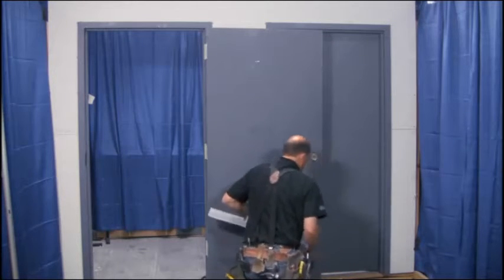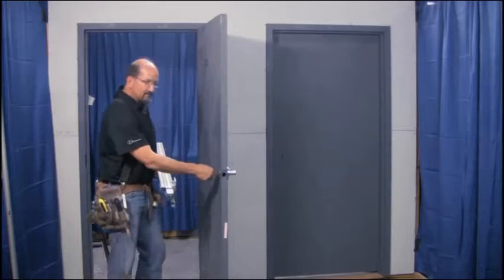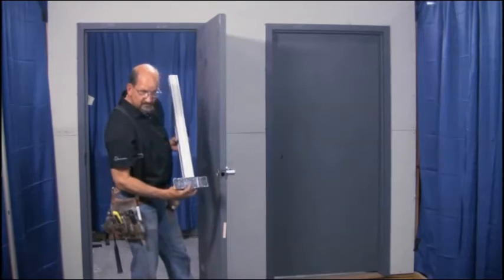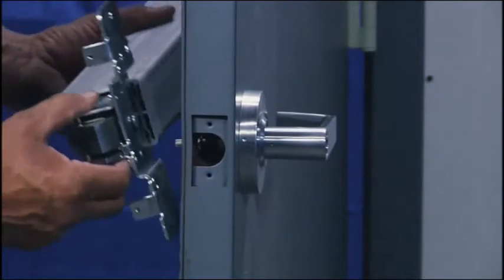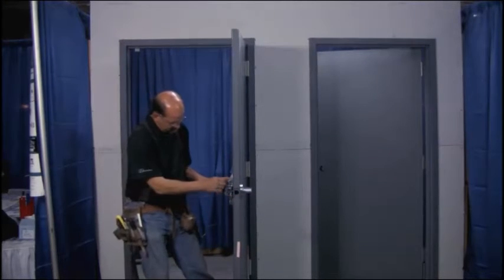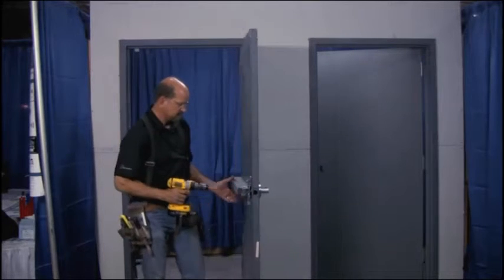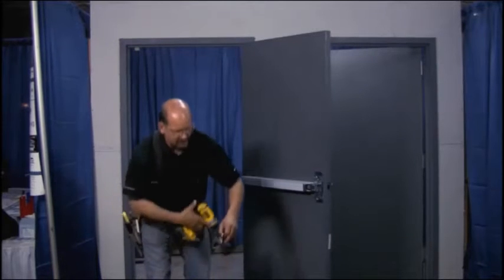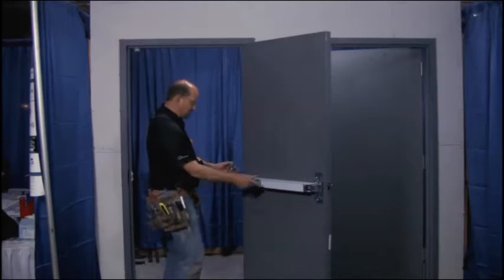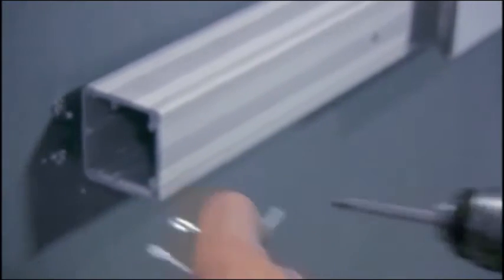There are a couple of ways to do this — you want to make sure you've got it good and straight. Some guys will use a plumb bob or level. To install the panic on the key-in lever trim, this is an X or star-shaped sleeve that goes into this insert right here. All you need to do is line that up and slide it on just like that. Put a screw in there to hold it in place — one screw will get it for now. Now we're going to put the end cap on. Notice the end bracket has two tabs on the bottom and one tab on the top. The two tabs will slide right between the notch in the panic, then slide it and screw it on.